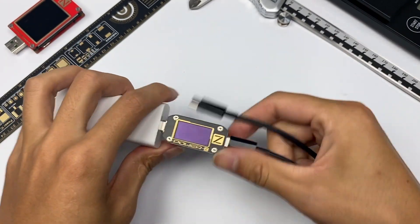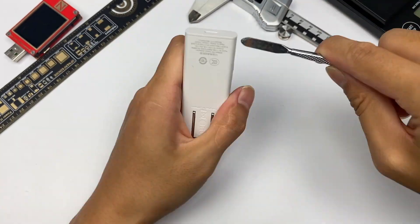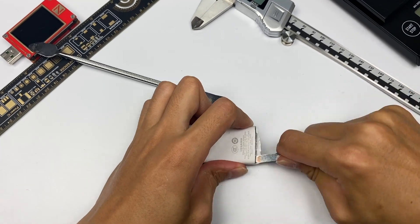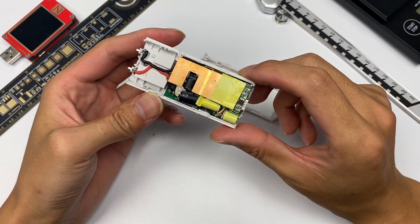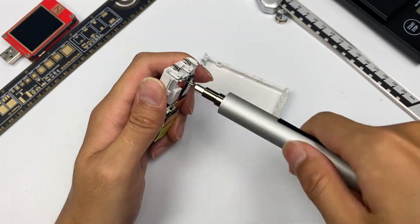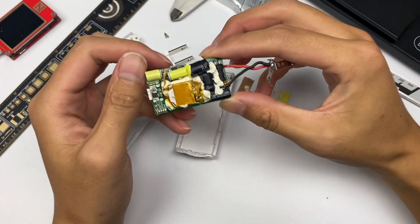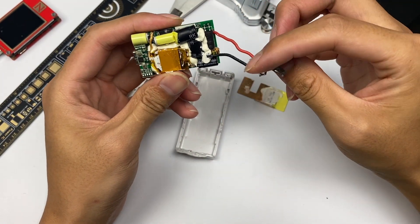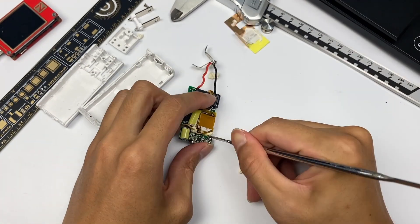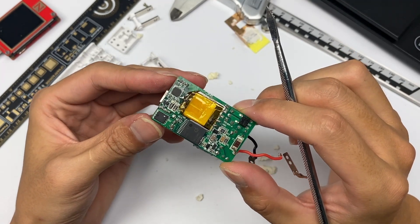After the brief introduction of this charger, let's go ahead and tear it down to see what's inside. After opening the shell, we can see the heat sink is covered on the internal PCB, and this is the insulating tape. Taking out the PCB module and removing the heat sink, there are lots of thermoadhesives between the components on the front. To reduce the thickness, the capacitors and I-shaped inductors are placed horizontally. After cleaning up, we can see a hollow in the middle of the PCB, which is used to place the transformer.